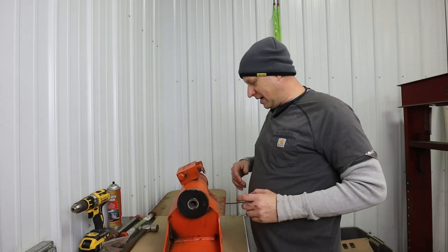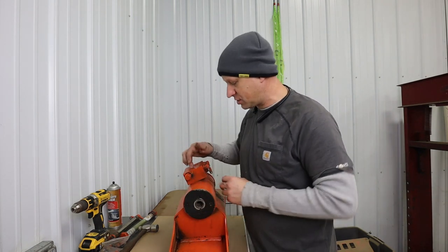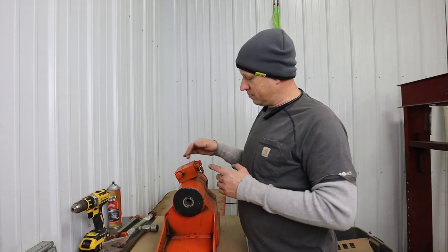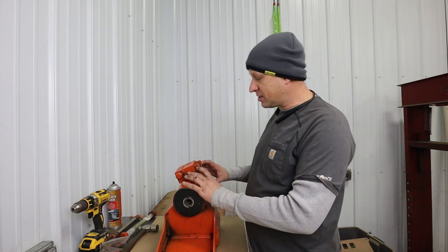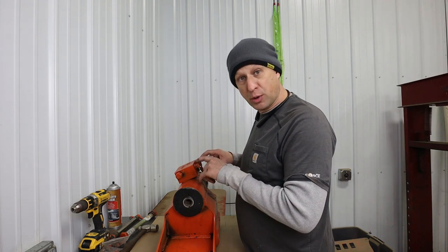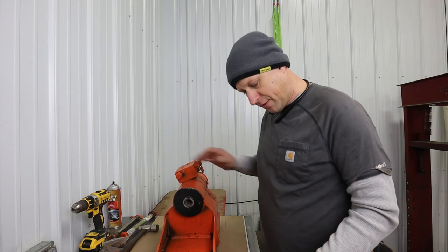So I think at first I want to take this off there. This is a safety valve. Essentially, on a lot of these things that are life safety related, if a hose was to break, you wouldn't want it to just fall. So this safety valve essentially holds all the oil inside here and does not allow things to change unless it sees differential pressure across both hoses. So it makes it safer. So let's get this pulled off of here.